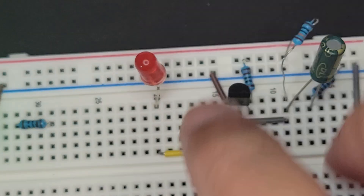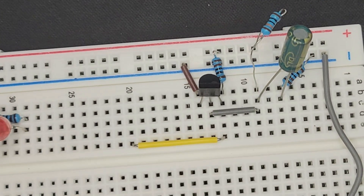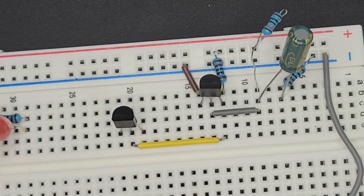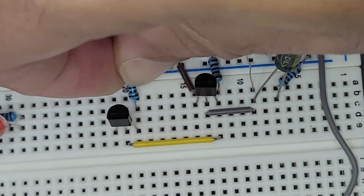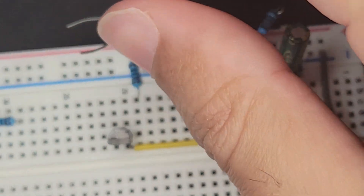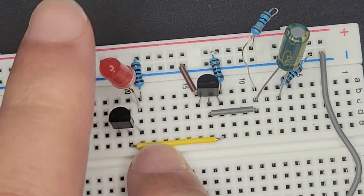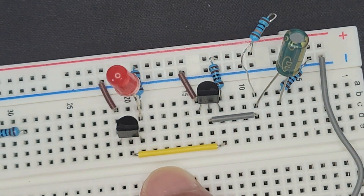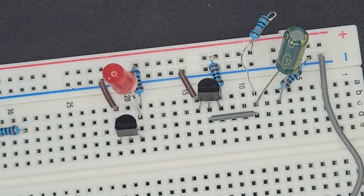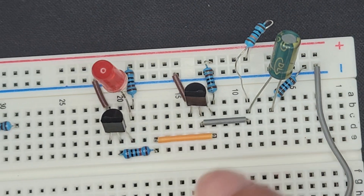It is back to how it was — LED turns on initially, then it turns off after a second. So now I'm going to discharge them again and rebuild the inverter system. We have our output on the yellow cable, which is going to go into the base of another transistor as we had it before. This new transistor is going to have power going to its collector. And then we have our output — now it's just going to be the red LED, so I'll put it back. So he's grounded. When this transistor is off, the LED must be on. We need ground now, and I'll put a 10K in there. Capacitor should be discharged, which means the base has no energy because it shares this junction.